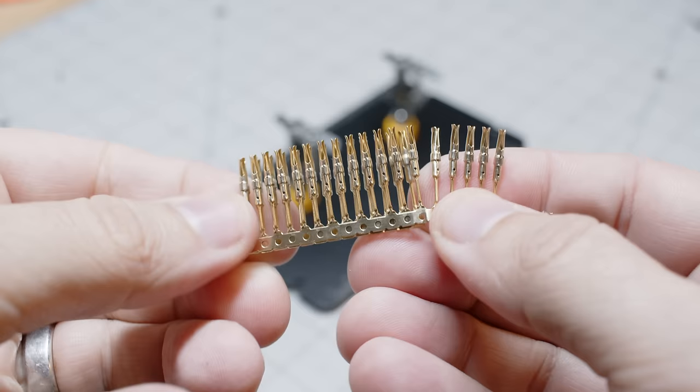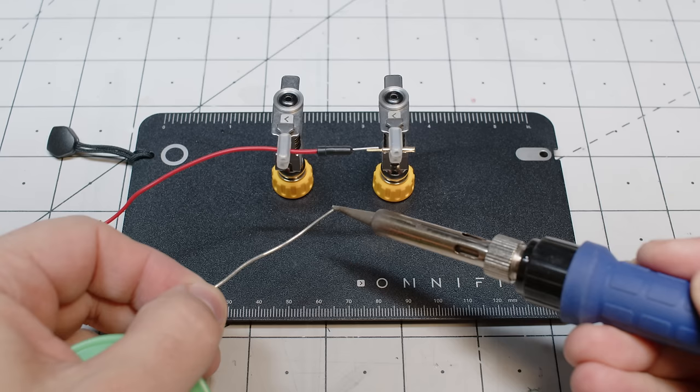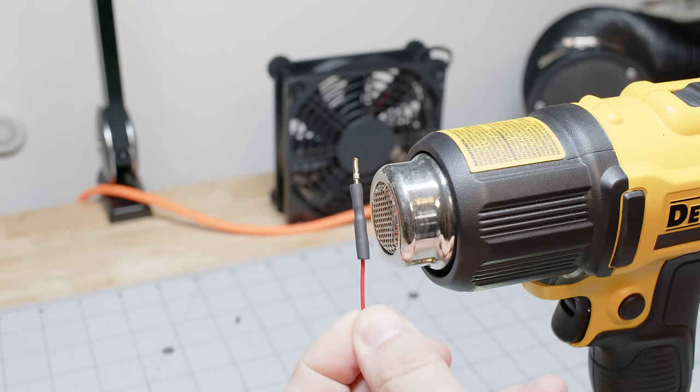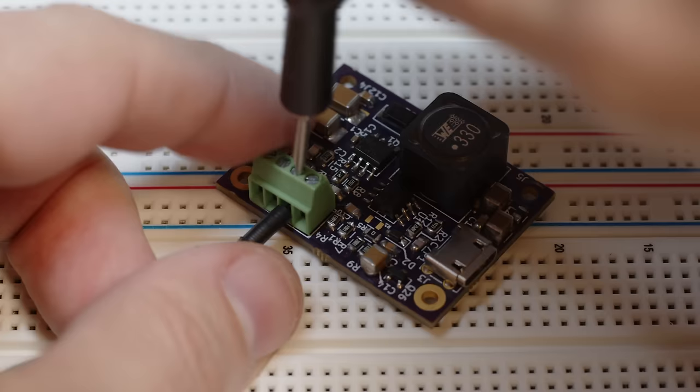An important part of designing anything is prototyping. I'm creating these custom cables that I can use to hook up the Nixie tubes onto a breadboard. This way I can test the circuits in isolation before laying anything out in a PCB designer or schematic or anything like that.